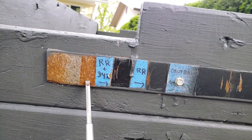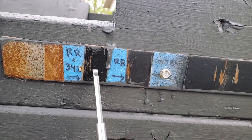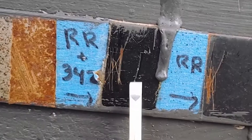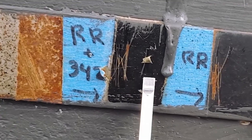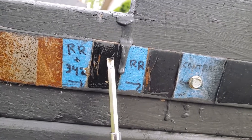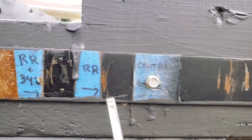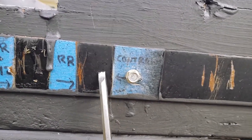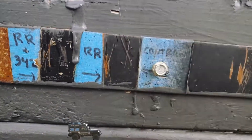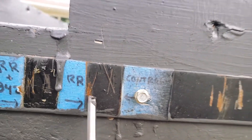As you can see, the control is rusty. Right next to it is the rust reformer plus RP342 — we could scrape that away here. You can see the RP342 there, and underneath is bare metal with no rust. Right next to that is just the rust reformer, and you can see no rust there. These scratches represent the three-month mark from the six-month update.